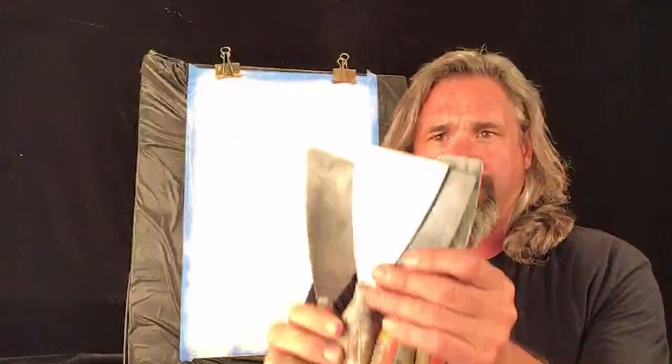Let's talk about tools. These are our putty knives and spatulas from Pavan — various sizes for various sized walls, high-quality stainless steel. It looks like a putty knife, yes and no. These are considerably higher quality because of the stainless steel — this is not blue steel. They will never rust, but they will leave carbon deposits on soft colors. So if you're using white, pastels, or light colors, make sure you use plastic. Same with the trowel.